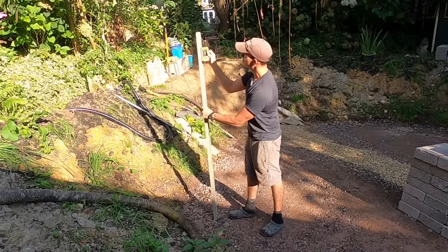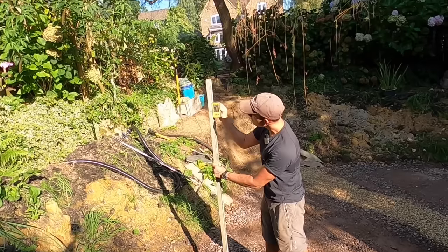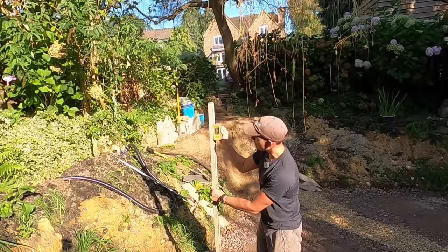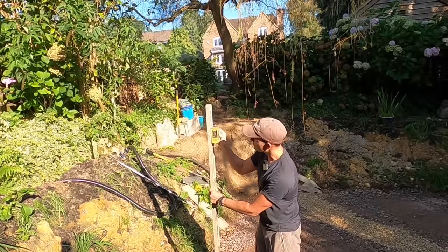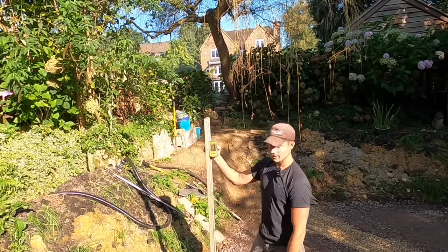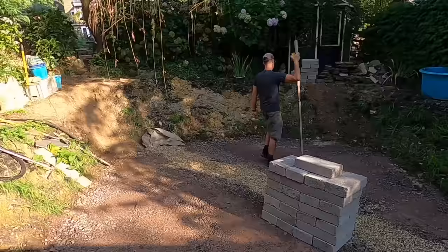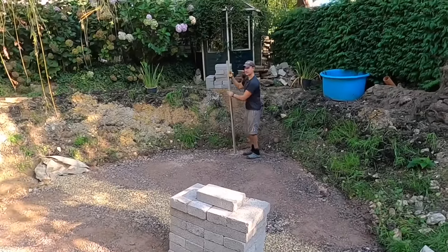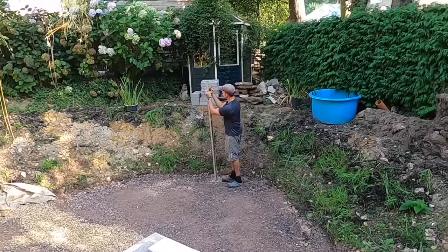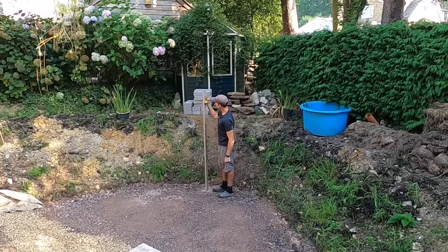Using a simple laser on a tripod with a receiver. When I get a fixed tone, like that, that's marked up on the laser. And then I can make a line on my level here as a visual guide. And then based on that line, I can compare it to over here. And we've got more of a difference than I'd like.